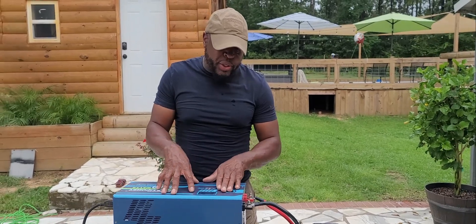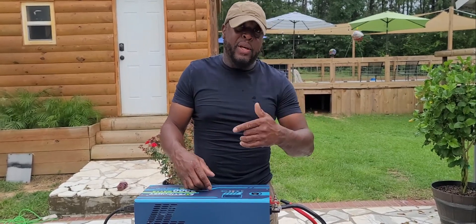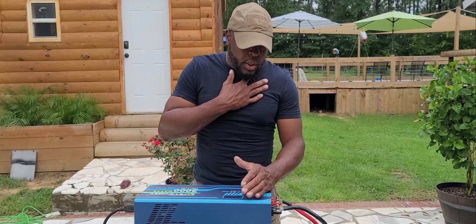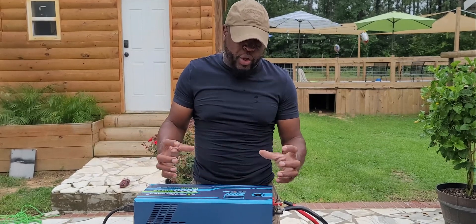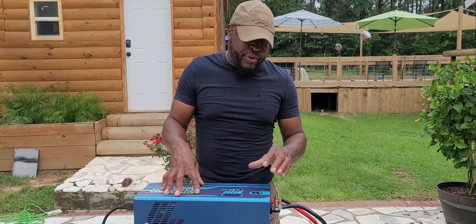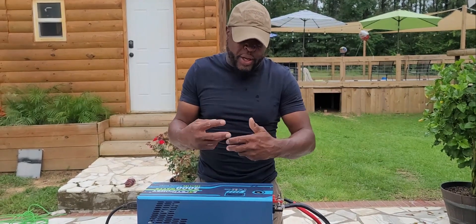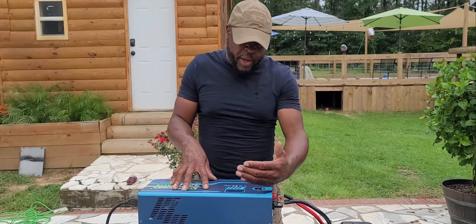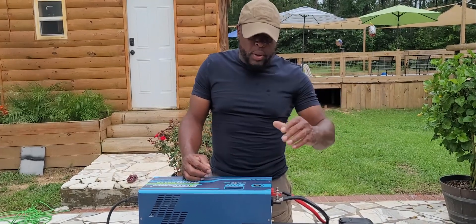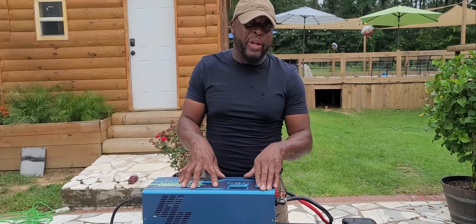What I'm going to be doing inside of my storm shelter, I'm not going to do shore power. I'm running separate electrical wiring for my plugs, my TV, and my lights. The reason why is I don't want to splice into my shore power that goes there. So if this unit goes out in a few years, I've got to put my shore power back together to have that continuous flow. So what I want to do is run it off solar, charge controller, and battery bank — DC only.